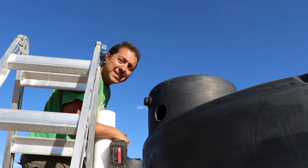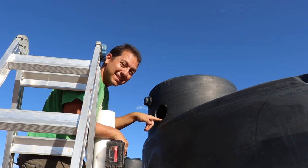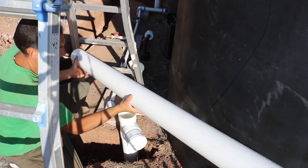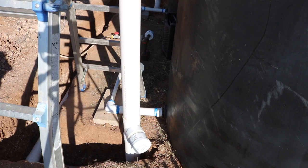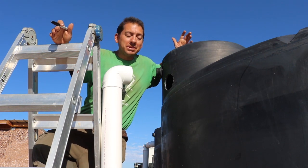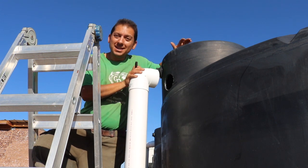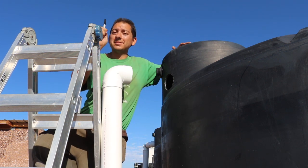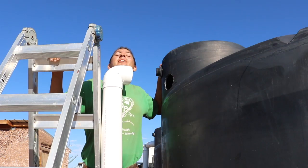Success! I take my time drilling this thing because I don't want to make any mistakes. But now that I got my hole in here, I want to get this attached ASAP. Now I just had this idea — it would probably be pretty obvious to some people, but it just came to me. I need this 90 to face a particular direction, pretty close to accurate to get right in there. So what I'm going to do is use this marker and make a mark on my 90 and my pipe. That way when I glue it, I can get it exactly to where I need it to be.